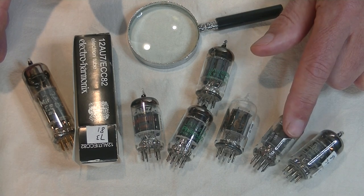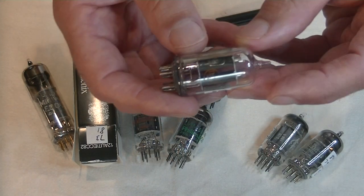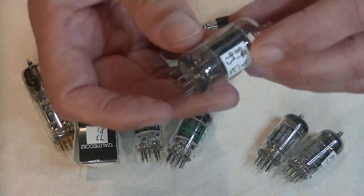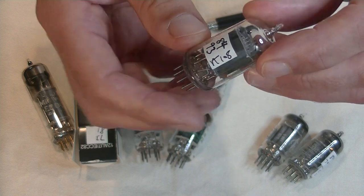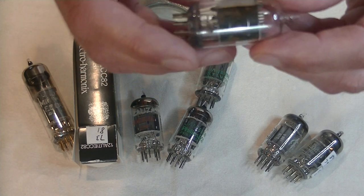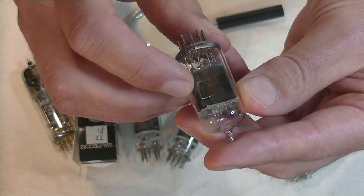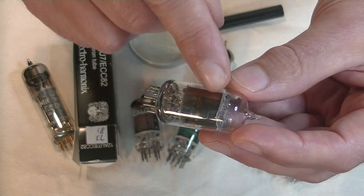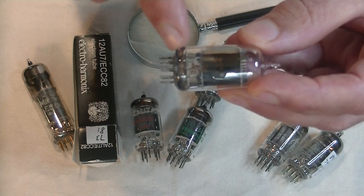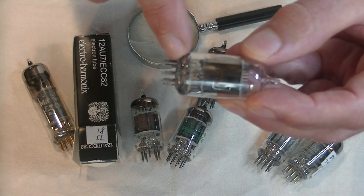In fact, I like these so much I didn't want to move on to the next tube, which is my number 108 RCA clear top — much loved by bottle head owners. It's a flat plate with three ribs. The reason it has a clear top is because the getter and the chrome are on the side — a single side getter. There can be bottom getters as well, and double or single top getters, side getters, double side getters, single or double bottom getters. They all help identify a tube.